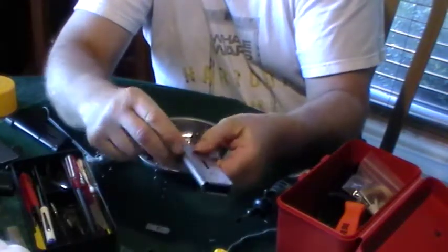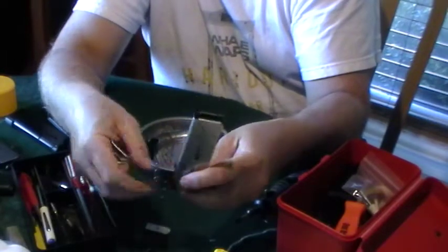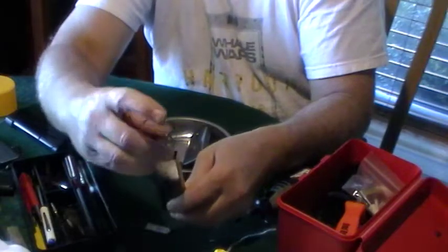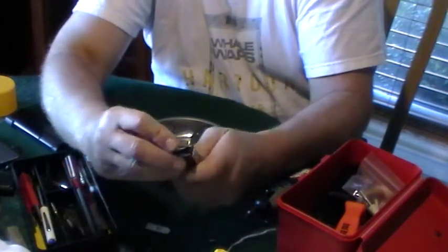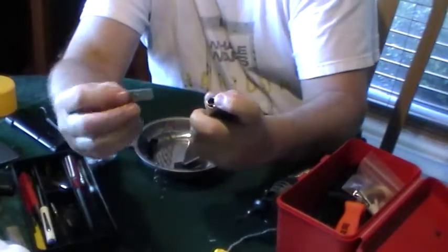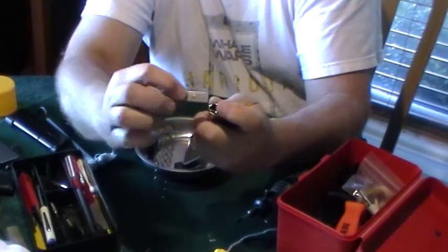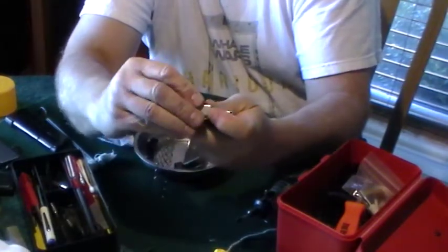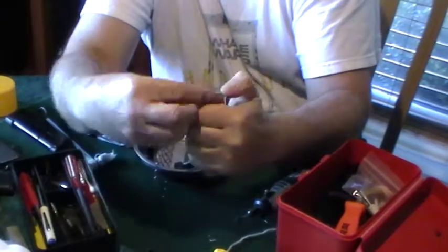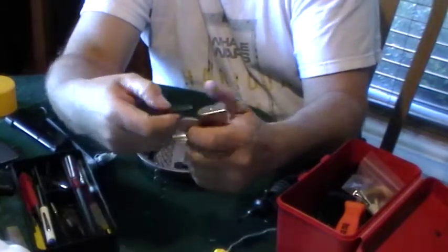So I have my follower in here that needs to be laying the right way. Then the spring is going to go in here and put tension, so I have to get the spring in there. Once I get the spring down in there, I'm going to slide the little spring retainer or clip retainer. Remember, nipple up, because it's got to bounce. That nipple's got to bounce into the retaining pin there. So I get that good and in the center. And then this should slide right over.